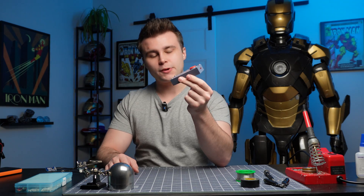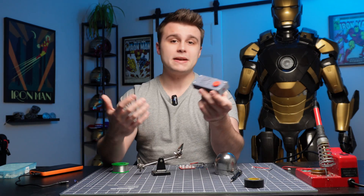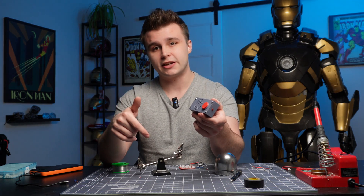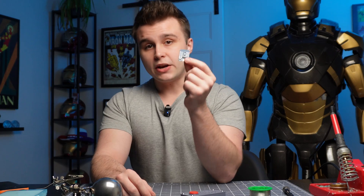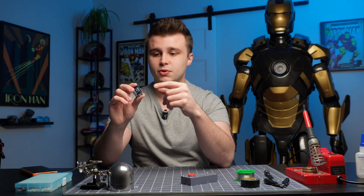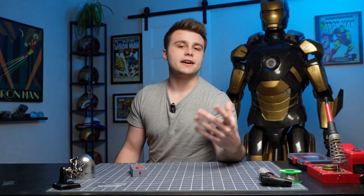There you have it — a complete 3D printed remote control. I basically spent an afternoon in Tinkercad making a few prototypes and landed on this design. I'll leave a link in the description to a Thingiverse page where you can download the files. For soldering the receiver board inside the helmet, we need two JST-PH connectors: one for the switch pin and one for power — four wires total. One red wire goes to the 3.3V power input, another red wire goes to the switch output which is D1, and the two ground wires are soldered together going to the ground pin.